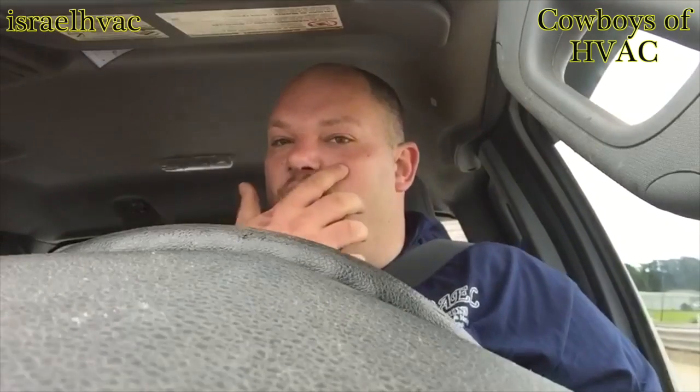Hey guys, we're headed back over to that job where the compressor was in thermal overload. I didn't get any more footage yesterday. Basically, the reason that it was in thermal overload was because the system was dry on charge. It doesn't have any charge in it. So I pumped it up with 300 pounds of nitrogen yesterday, and I just didn't take the camera out because it was Saturday evening and I was trying to hurry up and get done, but no luck finding a leak. I couldn't find a leak at all.